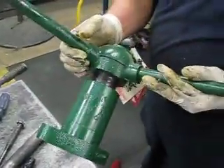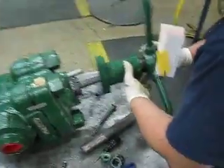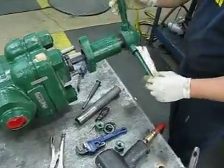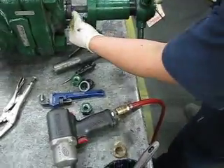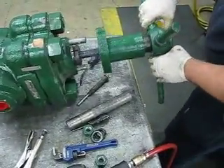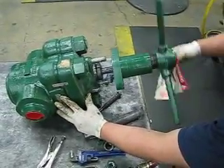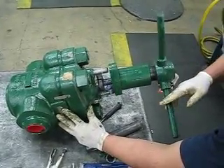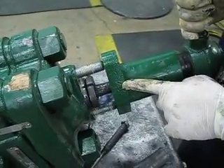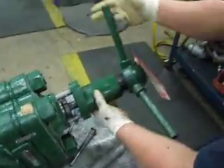It's going to stay the same — you don't want to mess with it because that's your timing. Now you're going to go counterclockwise and start screwing it back on the stem. What I usually do is hold the retainer down and pull the stem back. Make sure your stem's all the way up when you're doing this. Pull it back and keep going. Remember, your number stayed right there — that's where you're going to put it at. You're even already. Now grab onto the screw housing and open your handle. Now your screw housing is going to go down to your bonnet.